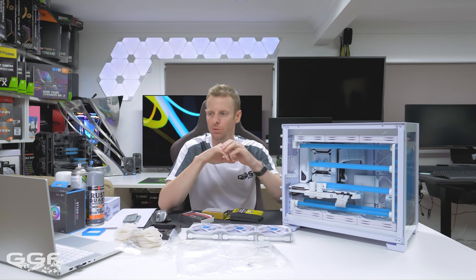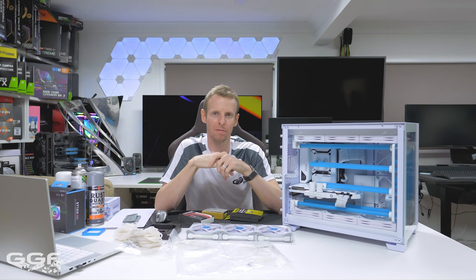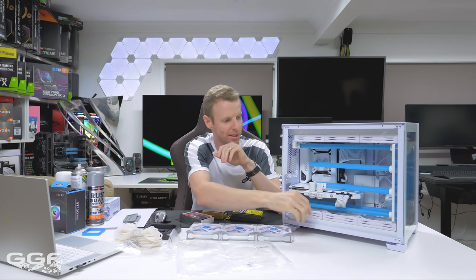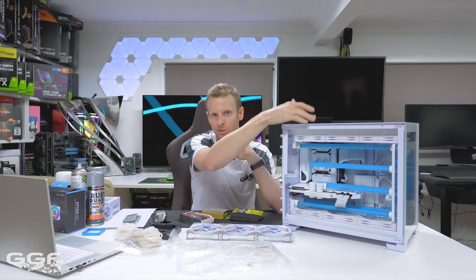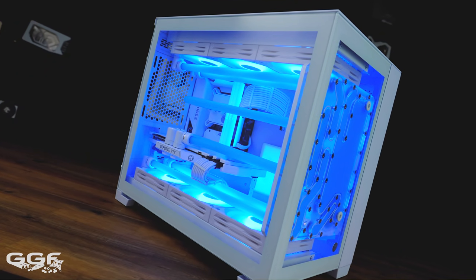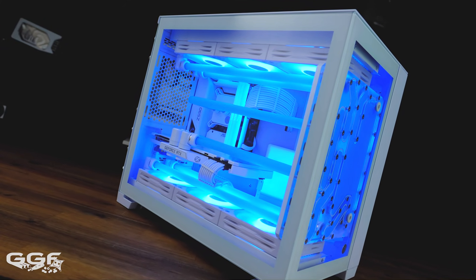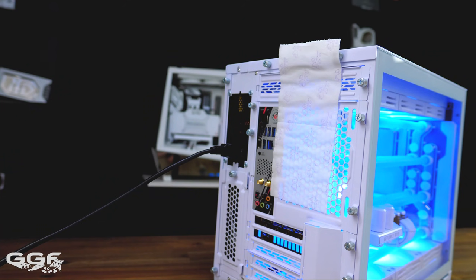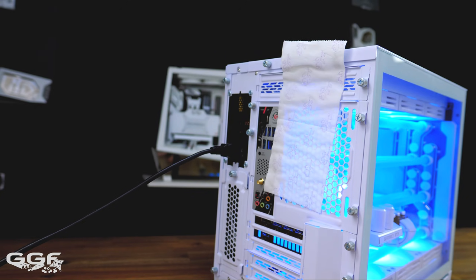And in terms of fans blowing out, I don't normally go aesthetics over performance, but for this build, I really wanted to keep the top fans and the bottom fans uniform, as in seeing the non-frame of the fan for the top. That's normally right for the top because that blows out. But for the bottom, you normally see the frame because you suck in and blow out. But in saying that, the performance hit, I don't think is going to be noticeable. I got the side fans blowing in, and once I have the side panel, there's enough pressure because this whole back is open as well. I can hold up a bit of tissue and it completely sucks it in on this side.